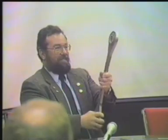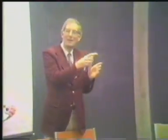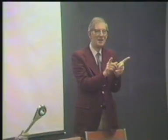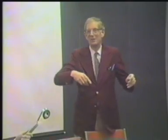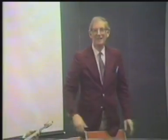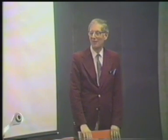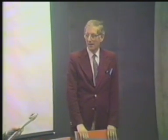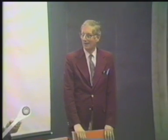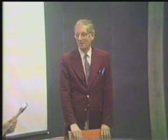What stopped the blades from drooping right down at rest? There was this tube that came in and had a little stop on it. The little stop was only about this long, so you can just imagine this great big long blade. Anyway, that's a simple stress problem, really, but some pretty high-grade material was required for that. These are fairly thin laminations, about 20 thou or something like that. Quite thin. Amazing.